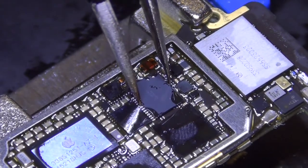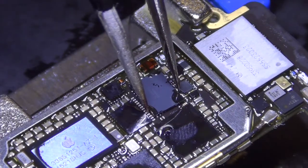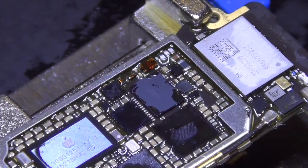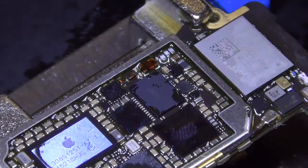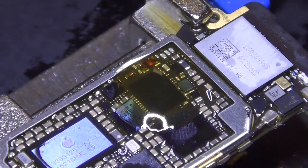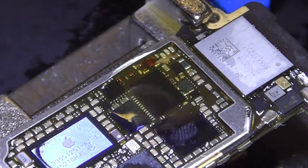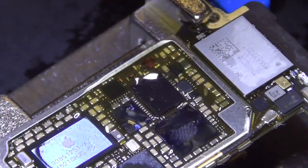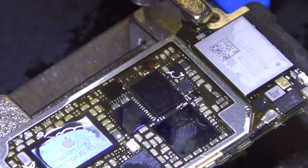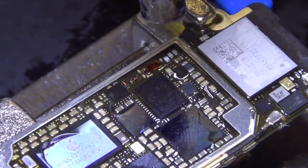There's no good way to do this aside from putting it approximately right on top of where it's supposed to be. There's really no stencil or anything to line it up. So it's approximately there. The next thing is you want to put a lot of flux — I probably should have done this beforehand. Flux does two things: one, it distributes the heat evenly; and two, it's somewhat sticky — it holds the chip in place so when you put hot air on, it doesn't fly. You want to melt the solder underneath, and the moment it's reflowed, the chip will move and self-align into the correct orientation, so it doesn't need to be precisely placed.